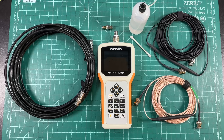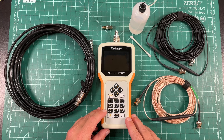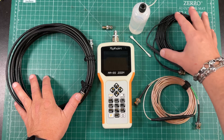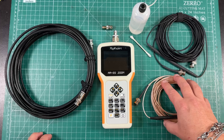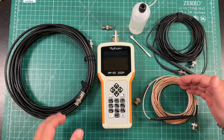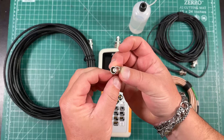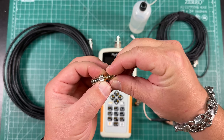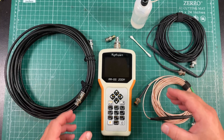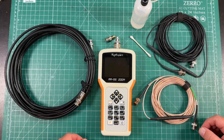Let's hop on the bench and take a look at the numbers. To conduct our experiment, I'm going to try to be as scientific as possible, but there are some variables. First, as awesome as this Rig Expert Analyzer is, it is not lab-grade quality — so keep that in mind, we are amateurs. We have three different lengths of coaxial cable: the RG-174 is 35 feet, the RG-316 is 25 feet, and the Airborne 5 is 30 feet. This should give us a general idea of the attenuation between these three. I also have a PL-259 to BNC female adapter on the Rig Expert, as well as a BNC female to SMA with the short from my Nano VNA. I've cleaned all contacts with isopropyl alcohol and a Q-tip to eliminate any contaminants, and coiling the cables makes no difference for these kinds of tests.